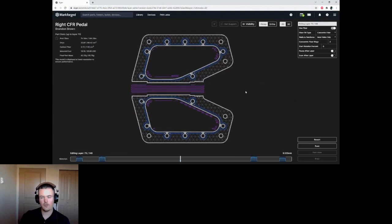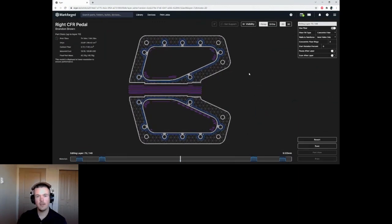Again, because these holes are pretty small, as you saw from the design guide, it's going to be a bit of a challenge to get fiber around these, because there's a minimum fiber length you have to extrude, and sometimes it's a challenge to wrap that around. If we change this to 3, we might be able to get it. But this is the closest you're going to get to being able to get inner holes reinforced or choose that, as of now, at least.